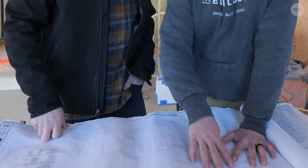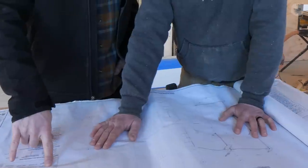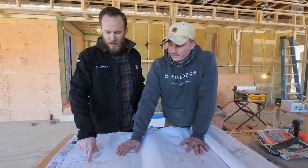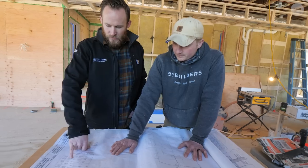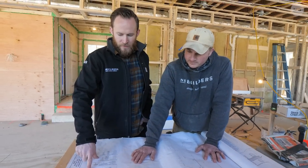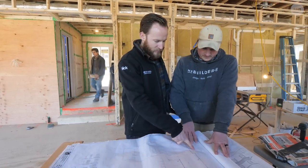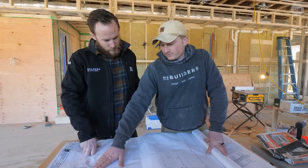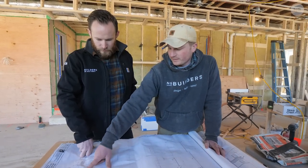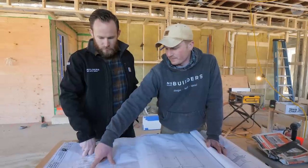You can take that, go over to your legend here — SW4 shows both faces, 7/16 plywood blocked, and then your fastener schedule: 4 inches on edge, 12 inches in the field, then calling out your fastener. The engineers called all this out. I see SW4 called out but also SW5. SW5 — you just refer right back to the plan — allows 7/16 plywood on the exterior face, which is the minimum they want.